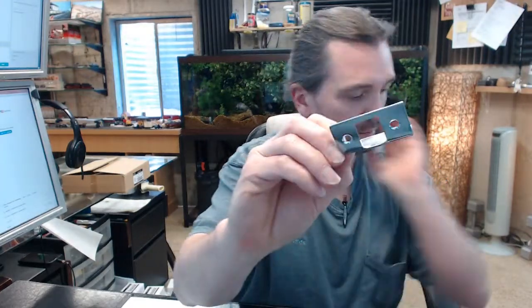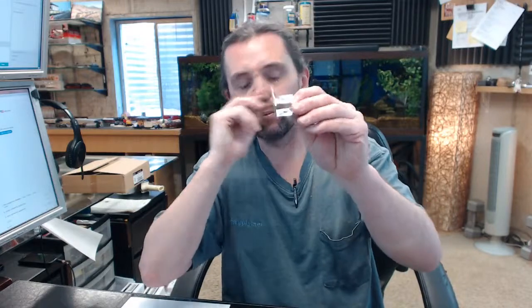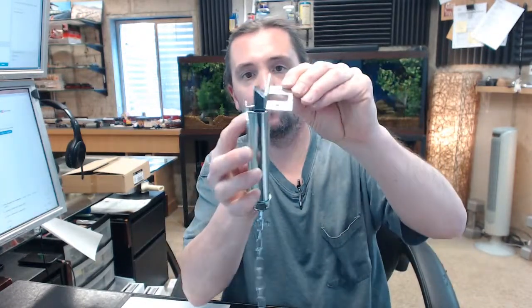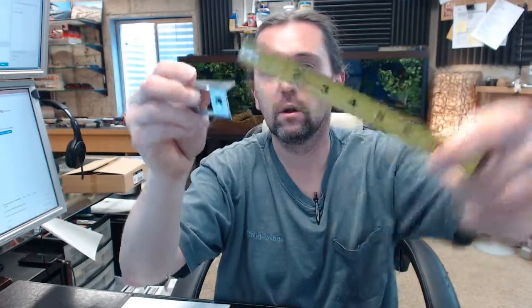Then you're going to get what would be called a mortise strike. That is what this is going to be used for. You can see how that's going to install from the image below. Basically you're going to need to prepare the frame itself for the bolt to go in, so that your approach in this face is intended to be like a strike guard against coming in contact. Let's get some dimensions on this. Length about 2 3/16. Depth 1 1/8. And then this projection about 11/16.